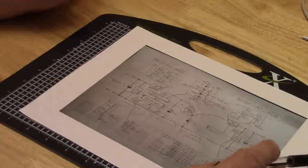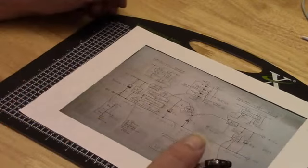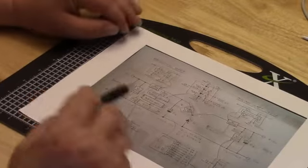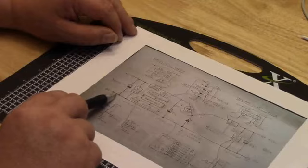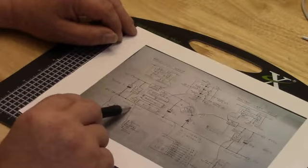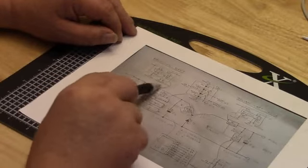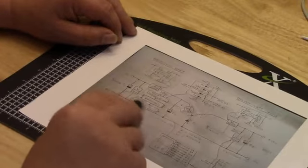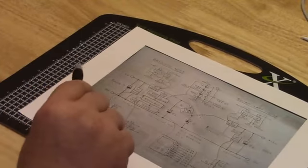Nothing wrong with it. Electrically, it works and it sounds. But I got a few life experience type of deals coming through. Over here, this is where the solar comes through. He has a capacitor sitting here, and he made a 100 microfarad capacitor at 100 volts. And then it goes through a current sensor, a voltage divider, and all this is fed into the Arduino. And then there's LEDs, and you got your display above it.